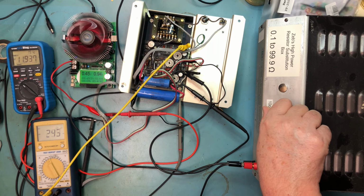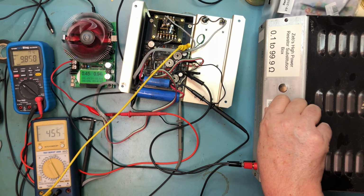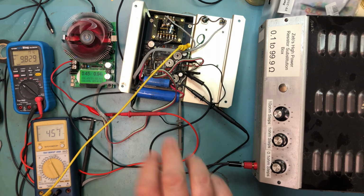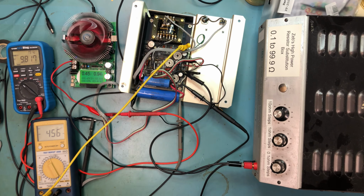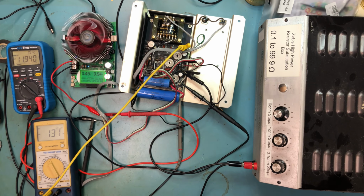I'm expecting this one to react about the same, honestly. Yeah, we're seeing the voltage roll off. So the design of the plus and minus, looking at the board here, it makes sense that the two of them would roll off about the same place. And I'm not going to push the minus 12 any harder than that, even though I think it's the same basic design, using an LM723 voltage regulator.